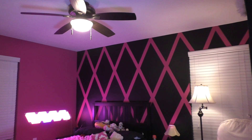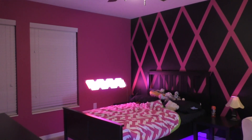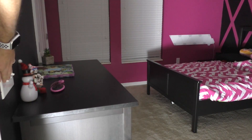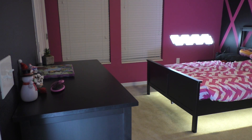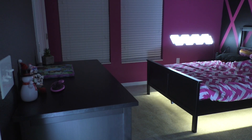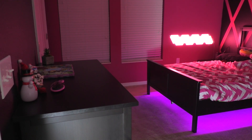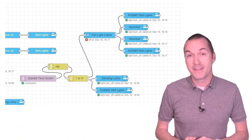In my daughter's room, I took it one step further. The three light switches in her room are wired to a ceiling fan, her ceiling fan light, and a switched outlet. It always seemed silly to have to flip two switches for the everyday lights in her room. When she recently got a room makeover that included underbed LEDs and Nanoleaf light tiles on her wall, it was annoying not to have a switch for those lights. Using Home Assistant, Node-RED, and a couple of Shelly devices, I can now flip the first switch to digitally activate the relays for her ceiling fan light and floor lamp together, and use the other switch to trigger an automation that turns on her Nanoleaf tiles and underbed lights. I also made it so that if you turn on the Nanoleaf switch first, the lights come on pink and purple, but if you flip on the main room lights first and then the Nanoleaf lights, they come on as warm white. Your imagination is the only limit when using Home Assistant, and Shellys are my favorite devices that enable this kind of functionality.